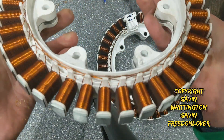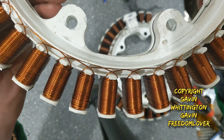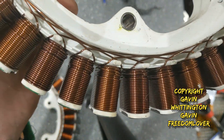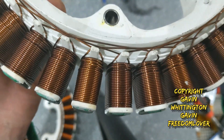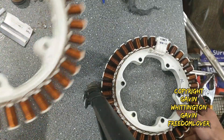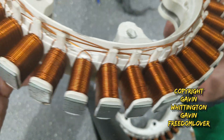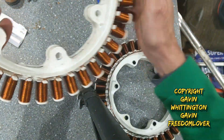So that's the copper wire — that's the one you want. I tried to count approximately 26 winds on this one and 20 on this one. You want to avoid the one with the brown wire and get the one with the copper wire. They do need rewiring to be used as a wind generator, but that's no big deal — I should be able to do that quite easily.